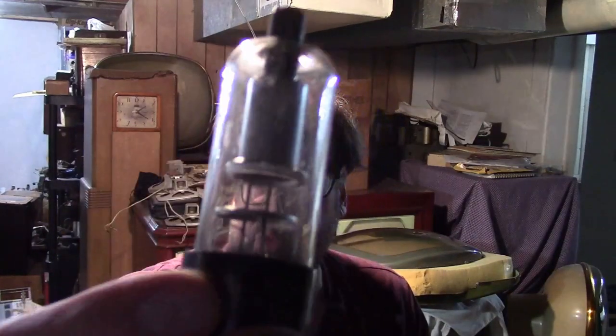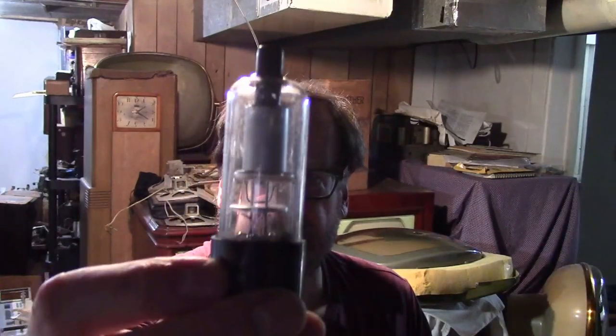So let's take a quick look. Here's a typical early 1B3 — there are two posts that go up inside and support the filament. A typical 1J3, which I currently have in my hand, seems to have a more beefy support structure. One thing I want to do in this video — something you've never seen me do before — is to break some tubes. I've got some 1B3s, 1G3s, 1K3s and 1J3s that are pretty well used up. We're going to break one of each open and see what's actually inside, because you won't find this talked about in the data books, at least not the ones I've looked at.